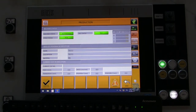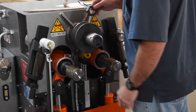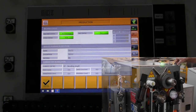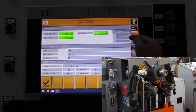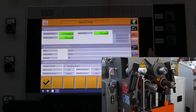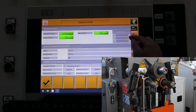The material is going to move forward and hit the encoder, which gives you the translation on the material. This is your start cycle sensor — it always has to be out. When the material comes through it highlights, then it retracts. This is our straight. Then you see the tangent at 65, 68.5, 68.2. The transition occurs, then your bending step — you can see the Y roll stayed the same and the Z moved up to its bending position.